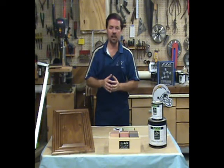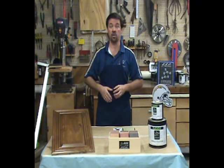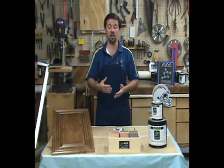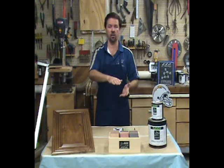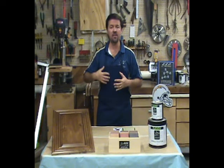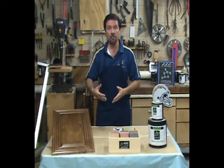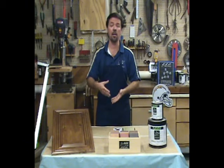Now, getting back to the fact that we're in Southern California, anyone in Southern California has been fighting with VOC issues and products changing for years now. Whether it was at 750, 675, 550, 275 VOCs, each time these changed, it was a big learning curve to work with. And in our store, we carry some of the solvent-based stuff as well, so we've dealt with all these learning curves each time. It was a major learning curve. But the guys just adapted, politically correct, the guys, gals, the people adapted to make it work.